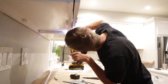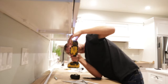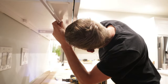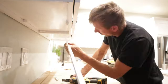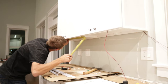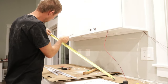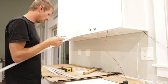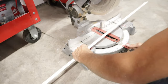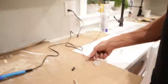I'm going to grab my DeWalt multi-tool, or oscillating tool, to make a precise clean cut for this channel. I really want it nice and tight - you don't want to oversize it. Luckily my channel is white and so are my cabinets, so they blend together. Since the channel isn't wide enough to span both cabinets, I'm going to seam them where the cabinets join so you don't see a seam. I marked my measurements and cut it on a miter saw with a steel cutting blade - came out really clean.